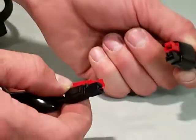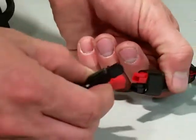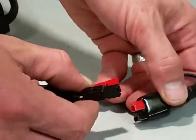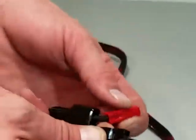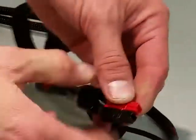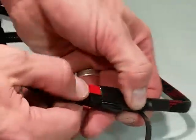Once you've popped them apart, look at where they need to go — back of the generator into the solar panel — and change the orientation to match up. In this case, I need to go red on top and then the black right below it, and they just slide together. The black has a tab, the red's got a groove. I just add the groove into the tab and check it. Now they snap together nice and tight.